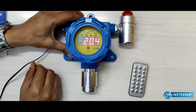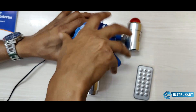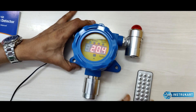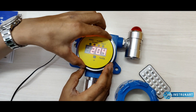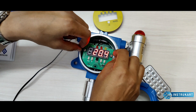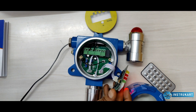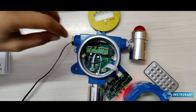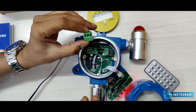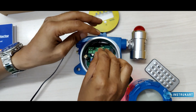I'll demonstrate how to connect the wires for the 24 volts DC supply. First, you have to open the top. There's a small clip on the display which you have to remove. After that, unscrew it so the top display comes out — this way you can remove the LED. From here you can just plug it out; it's pin-based. You can unscrew, put the wires in, screw back, and then put it back again.